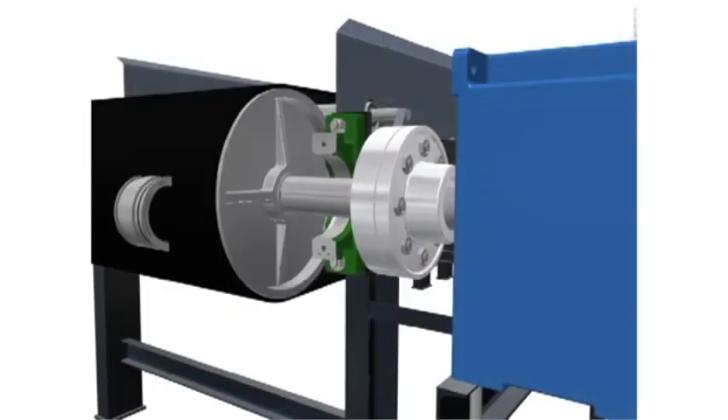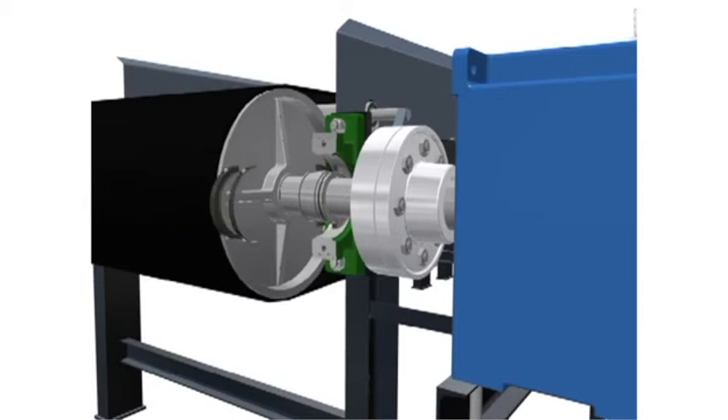The assembly procedure with a split cylindrical roller bearing allows you to replace the bearing without moving the coupling or gear drive. You can see in this animation how it all comes together. Think about places where we'd want to use this bearing — maybe where the bearing is trapped between a fan and a direct drive coupled setup, or possibly a sheave reduction in many fan applications that makes it a more timely replacement process.